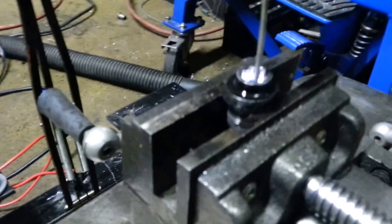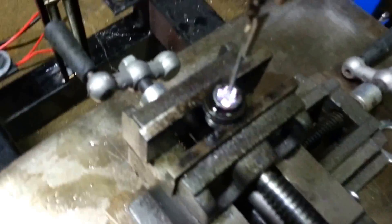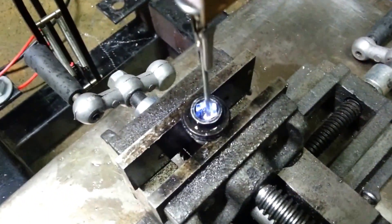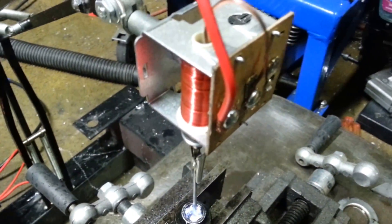In this case I've got a really hard plug here that I've got to punch a hole through to make an oil gallery. So what I'm doing here is just going to leave this running and it's going to electrochemically erode the work.